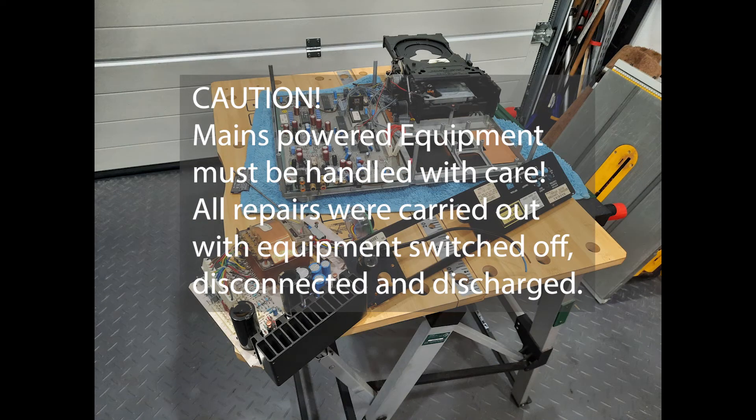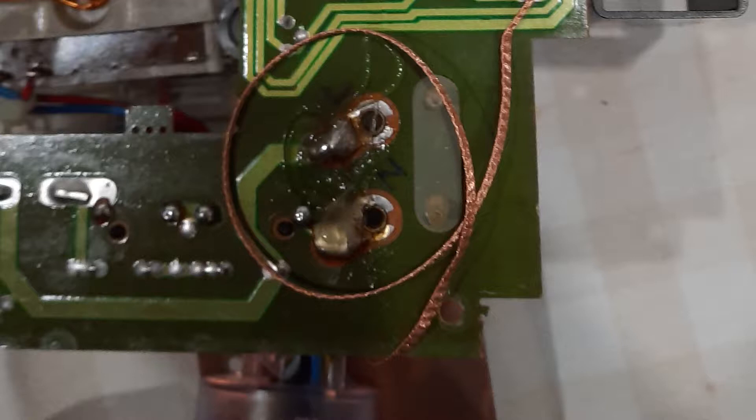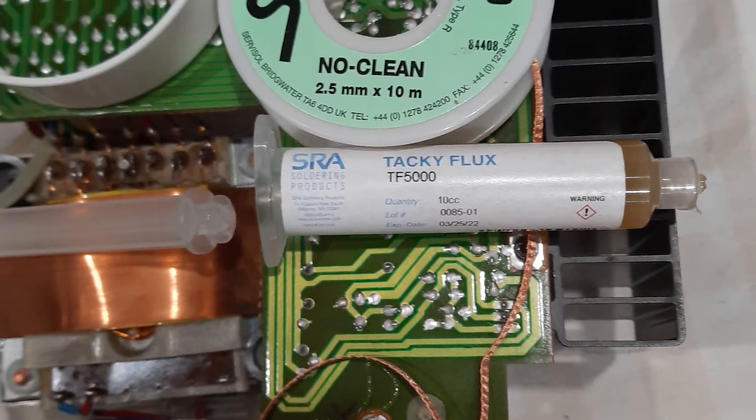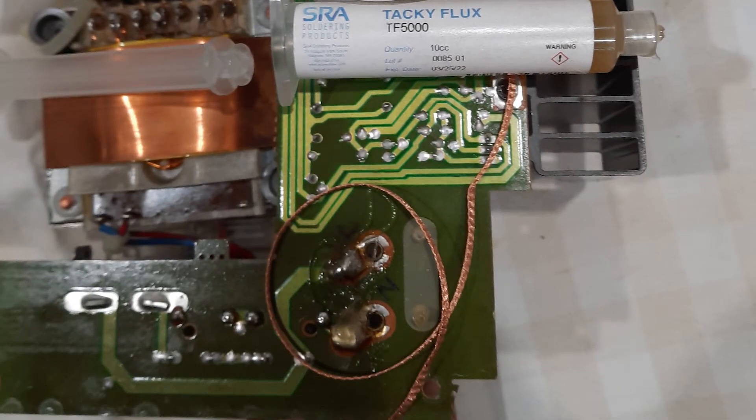With a unit like this I sometimes find it helpful to put it onto a portable work stand instead of a bench — this means I can access it from all around and avoid awkward twists and turns. It's potentially damaging to move a piece of equipment that has some of its insides hanging out. The power cord has large solder traces and pads so there was a lot of solder to remove. To make sure this happened smoothly I covered the joints in tacky flux and used solder mop wick along with a large soldering iron tip — it's essential to have enough thermal mass. Too small a tip and not enough heat would lead to a prolonged removal which could damage the board.